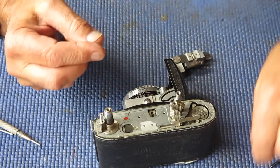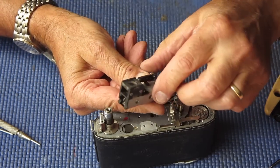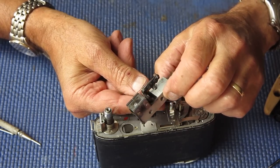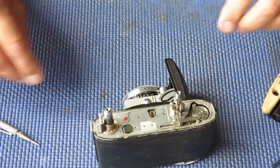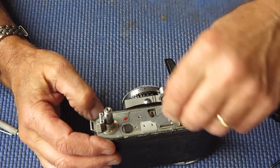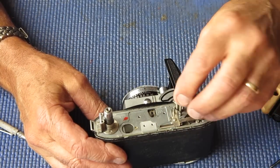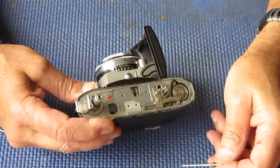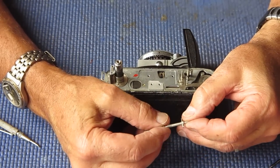The rangefinder is held in place by the correct screws. It's very filthy — I wonder you can see through that. Shutter release button, film release button, return spring for the film release button. The shutter release shaft — I'll lift that out. On this camera it's a two-piece, it's got a little collar on it. You'll be careful not to lose that collar if it's present.